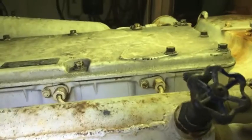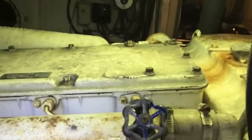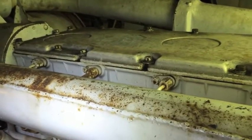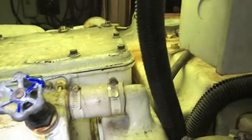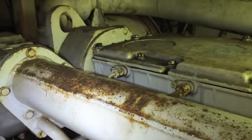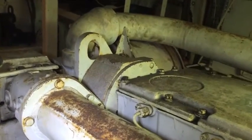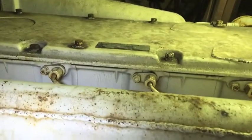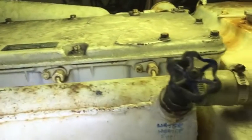My other big question is about the glow plugs on top. I can't find any wires for the glow plugs, and I can't find any switch anywhere on the boat or at the helm to activate them. I did have to start it one winter and it wouldn't start without the glow plugs. So I shot a little bit of ether into the air cleaner and it fired right up and ran fine. I don't know if that's good, bad, or intended. If you could let me know where the wires come out of the head, I can check if I have them.